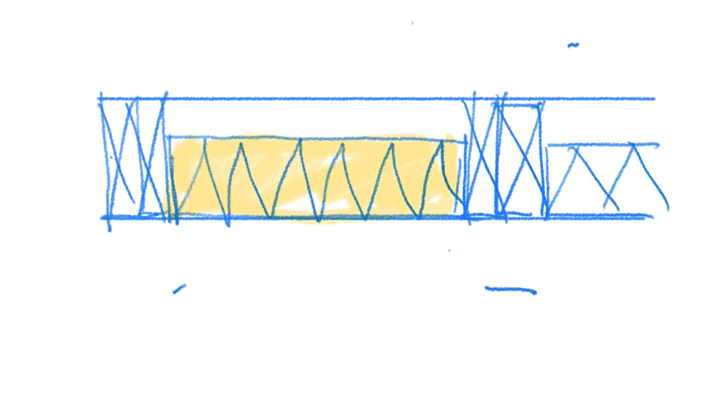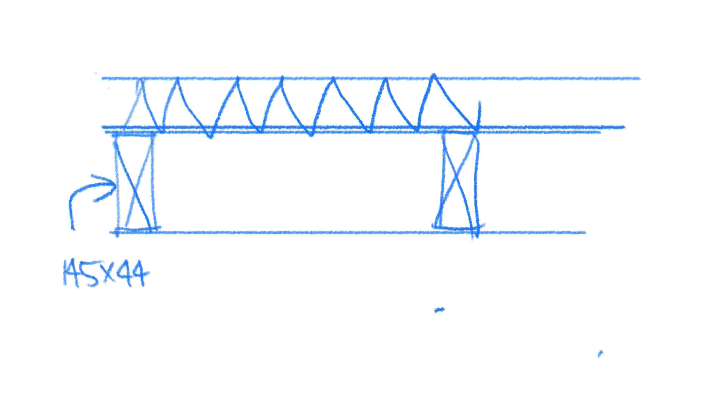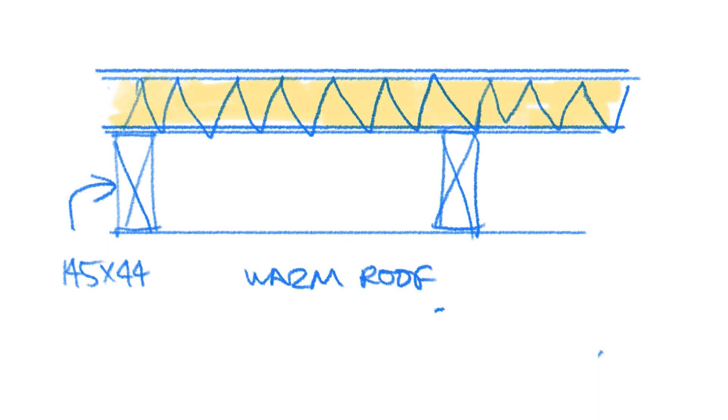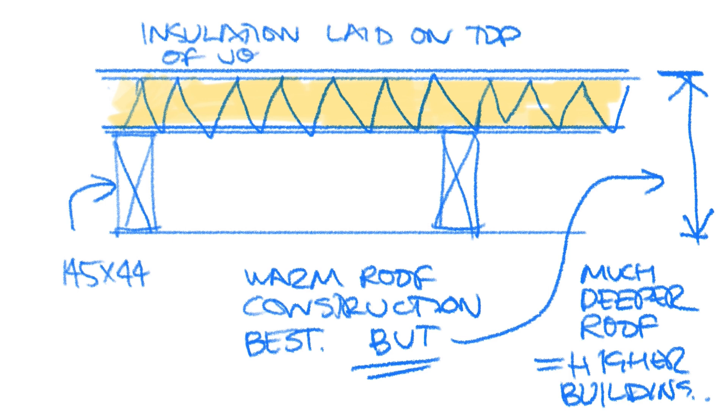90 millimetre insulation will give us a ventilated space of 30 millimetres for a cold roof if we use soffit vents — 50 millimetres is preferred. Or you can put the insulation hard up to the underside of the roof deck if you're mindful about how occupancy can affect condensation. Of course, if I didn't have to worry about keeping below 2.5 metres height for permitted development, I'd go for 145 millimetre joists as I wouldn't have to double it up, and I'd also consider sticking the insulation on top rather than between to form a warm roof. Now normally I would recommend you get a structural engineer to calculate these sizes for you, but the whole point of building small home extensions and garden rooms under the size of permitted development is that for many situations your project will be exempt from building regulations and therefore it's no longer obligatory to get a structural engineer.